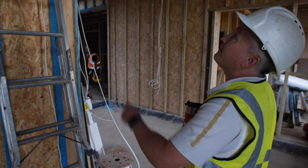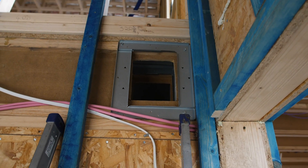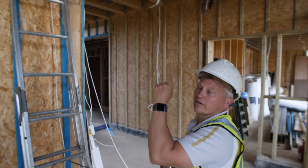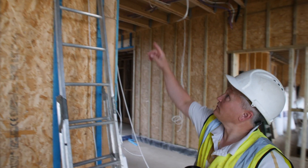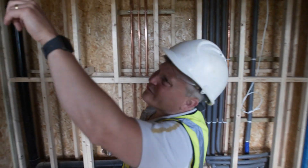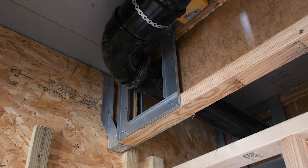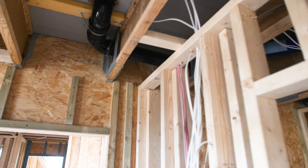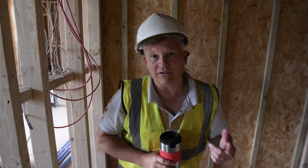You can see that's a special bracket — you wouldn't normally be able to do that on this joist so close to the end. That hole is there because they needed to feed a pipe through it. You've got a bunch of joists, a pipe picking up a bathroom on this side, and we needed to tie it in with a waste point on the floor. There's a long section of pipe involved — there was no way to put that in unless you could slide it from the outside where it's open. That was a solution the SIPS team came up with.